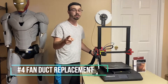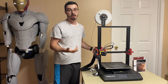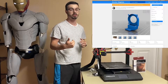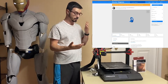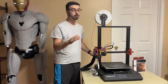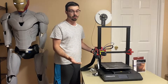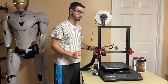Coming in at number 4: get yourself a better fan duct. My fan duct — I don't have it on display here because it's actually on the printer and it broke. It's only on one hinge, and you'll see in the corner of the video that model is the one I used to replace it. You want to print it in something other than PLA because PLA will melt and deform. Get it in PETG or ABS. It's got three hinges instead of one so it won't fall off. Make sure it's perfectly smooth and getting air in the right place. Mine had to be replaced in about a month — the stock fan duct was not great quality or design. I highly recommend getting that mod if you have any issues with that mount.